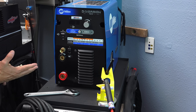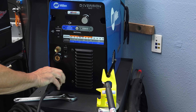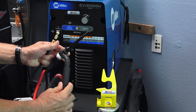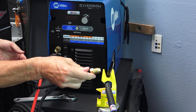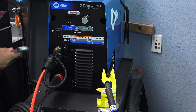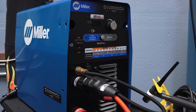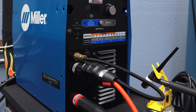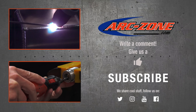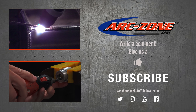We've got the bonnet back on the machine and all the connections updated on the face of the machine. See how nice that looks — simple work lead connection in and lock, the TIG torch connection. The beauty of this is you get to choose from the popular TIG torches: flex head, rigid, modular, whatever you want. Install the gas connection and tighten that up. There you have it — a high performance Miller Diversion 165 or 180 upgrade kit from ArcZone.com. Be sure to subscribe to ArcZone's YouTube channel to stay up to date on tricks of the trade, industry news, and the latest tools and trends. Thanks for watching and good welding.